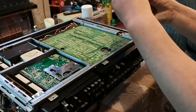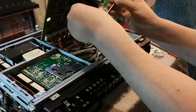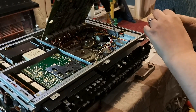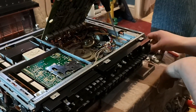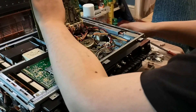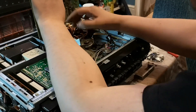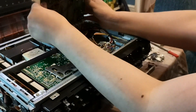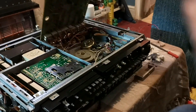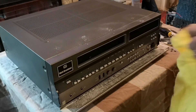Replacing the motor, greasing the gears, and putting it all back together — then obviously testing the unit to make sure it all worked. The motor itself plugs into that board you can see propped up there. You have to remove a small two-pin cable plugged into the board and undo some flexible metal retainers that hold the loom in place. Once those are out of the way, carefully remove the cable from the machine. When replacing the motor, just be wary of where those cables route and make sure you route them back into a similar place.